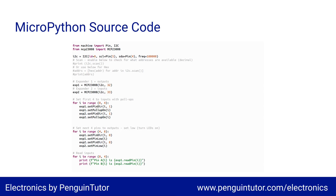Here's some sample source code in MicroPython. You'll first need to download the MCP23008 library — I'll include a link to that file along with all the other source code on my website. I essentially create an instance of the MCP23008 class for each of the GPIO expanders. I set the first four pins to inputs using pull-ups and the next four to outputs, set to low, which allows current to flow through the LEDs, turning them on. At the bottom of the code, I scan the inputs to read their values from both expanders for each individual pin.